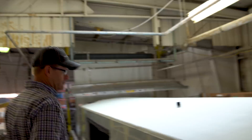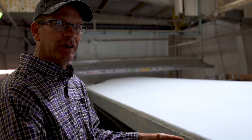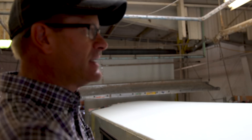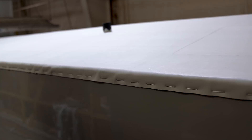Now we've got to the position where the three-eighths-inch marine-grade plywood has been installed and moved to the next station, where the one-piece rubber roof has been installed on the trailer. That's a single sheet of rubber spooled out all the way along. You can look at this roof — the one piece went side to side with no big bubbles, and you can see the fasteners along the side: straight, even, lots of fasteners. That's a well-put-together roof from the assembly side.